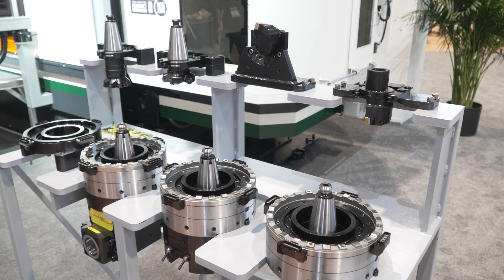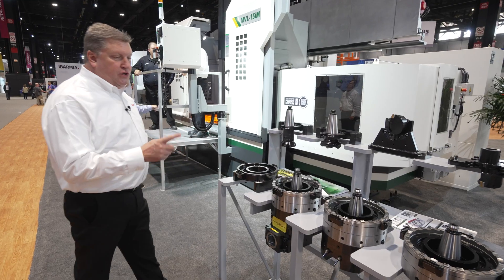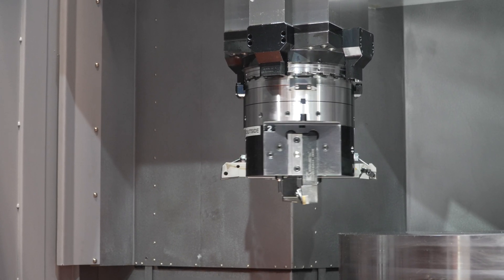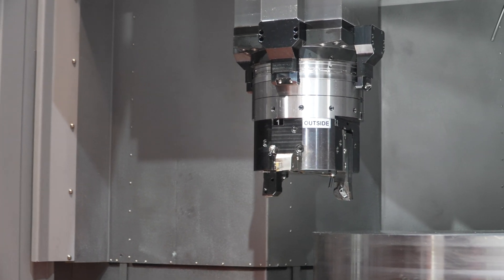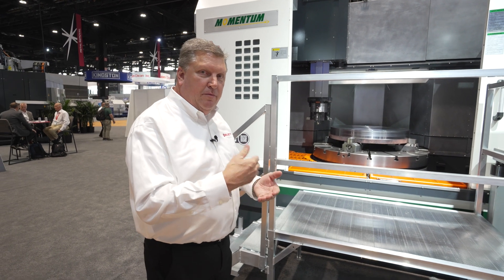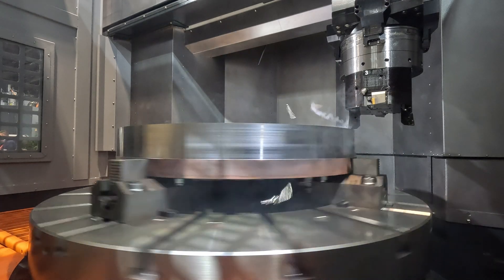We also have the ability to add additional capto pockets and an automatic tool changing capto head. With the SuperRAM, we also have indexing capability on the RAM. When we look at the face of the RAM, the RAM can have a four-position turret that indexes in 90-degree increments. So instead of one tool position per tool block, it gives us the ability to use four positions for every tool block with that feature on the machine.